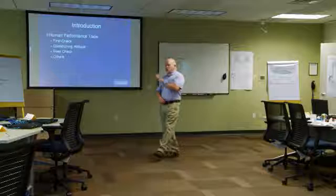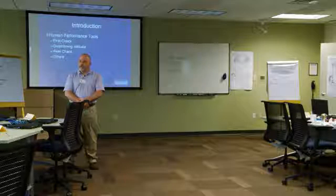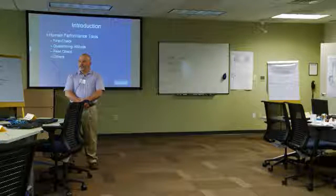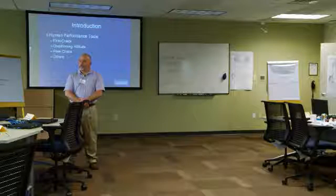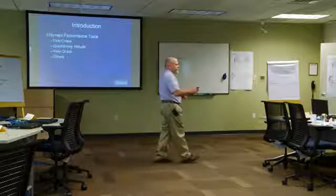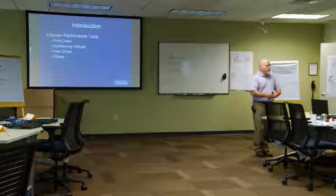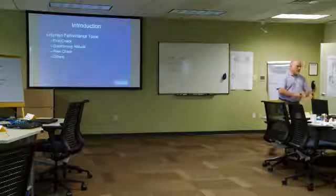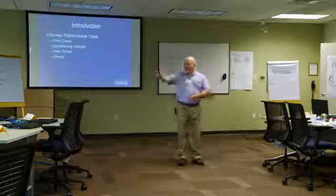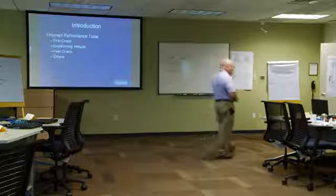Okay. Next one, peer check. When might you want to use peer check doing this task, Dave? Think specifically about hanging this ground on and when you might want to get your buddy to check this. Well, throughout the whole process, you want to have your peer check you to make sure you're doing it in accordance with the procedure and that everything is installed the way it should be. Okay, that's good. Somebody mentioned being de-energized. Maybe a good peer check here would be, hey, Eric, do I really have zero here? Would you check this for me? Dave mentioned grounding locations. Maybe he wants to ask this Dave, am I really on the right spot here? Okay, so those are some human performance tools that could be used.